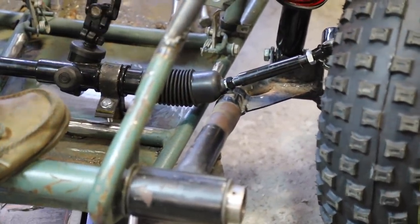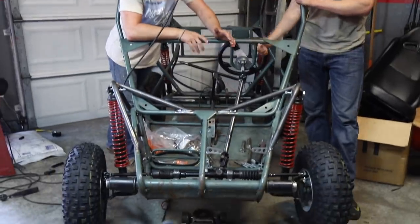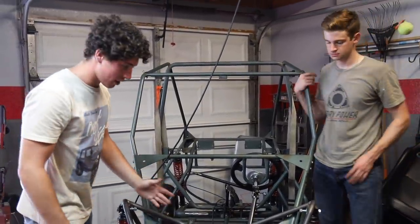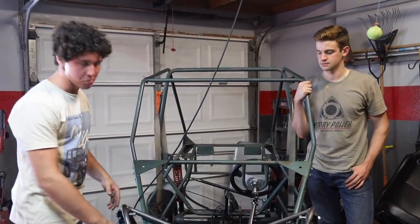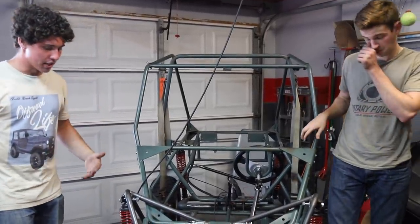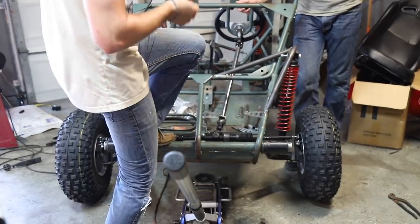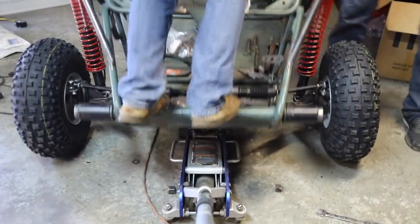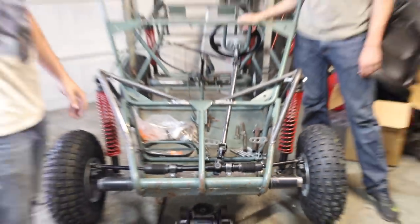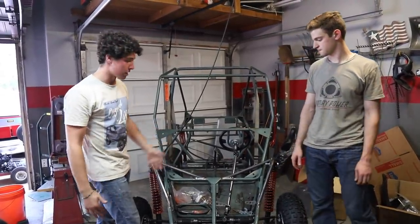It's kind of touching — really close. After redoing the whole steering, we moved it forward a little to eliminate some bump steer because it's closer to the pivot point of the J-arm. J-arms move in an arc and your steering is fixed, so it can cause bump steer. We got the best we could and it actually doesn't have very much bump steer at all. Our driver's side had contact at full flex before and now there's still about an inch of room. We're going to take this all apart, weld it up fully, and that wraps up our front suspension and steering.